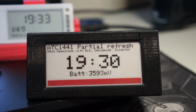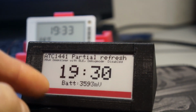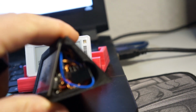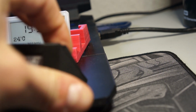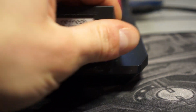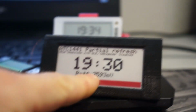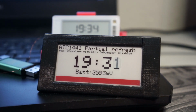About half a year ago I made my own display with an old e-paper display, and inside it uses an 18650 battery and an old nRF52832 Bluetooth Low Energy tracker, also a fitness tracker. This is running for about half a year, and has still a lot of power left, but it's of course a bigger battery.